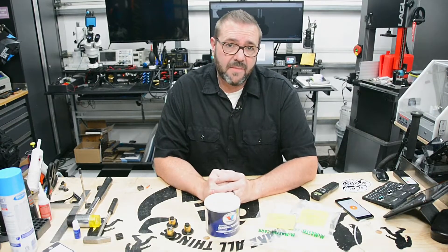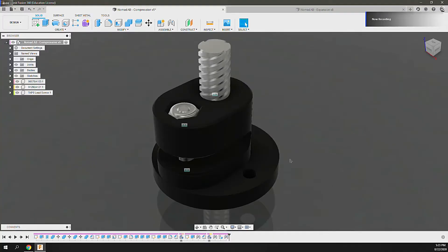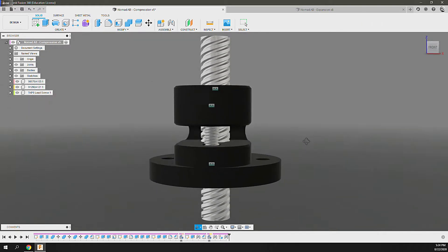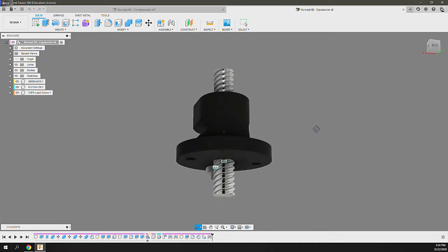To take it one step further, while I had the machine apart I noted the anti-backlash nut pocket dimensions milled into each axis, and developed two adjustable backlash nut designs. Both will be milled from Delrin and provide a set screw for adjustment of thread torsion against the lead screw. The first design applies compression via an adjustable screw and nylon lock nut, and will only contract within the dimensions of the milled pocket. The second design applies thread expansion via a grub screw and locking nut — the concern here is that under worst case conditions, expansion may exceed the pocket dimensions. Parts are available for both designs, and whichever you choose, all options are cheaper than a new machine or a ball screw upgrade.